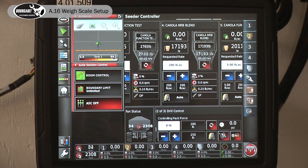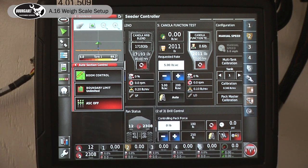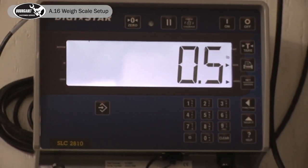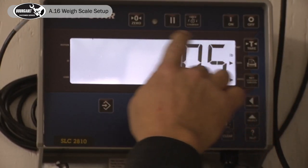With your new 7000 series card, if you have a saddle tank and the load cells, you would have it integrated where it can actually communicate from the load cells on the tank back to the X35. For example, I'll move it over to our canola tank — that's tank 5. It displays the recorded weight; mine is showing 0.6 pounds. There is a Digistar monitor located on the tank, and the Digistar also displays that.